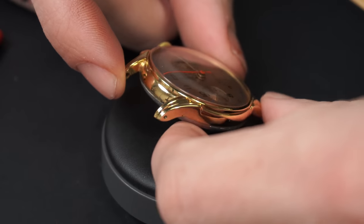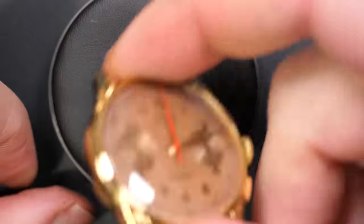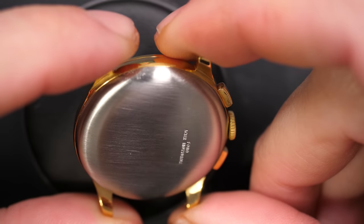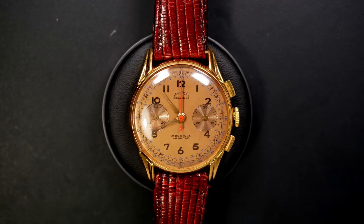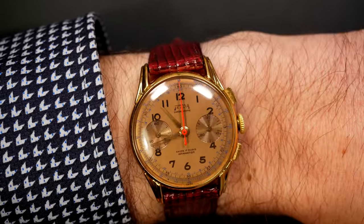Look at this beautiful gold plating - I'm really pleased with the end result on the case and on the case back. Look at that beautiful grain finish on the case back - so nice! I really love this watch. Now with this beautiful dial we have a beautiful case. On the timegrapher I'm not really pleased - the amplitude I would like to have at least 20 degrees higher. I noticed the mainspring barrel was quite scratched, so I'll probably change the mainspring barrel. The beat error is around one which is not too bad. But look at this beauty with this newly replated case! Hope you like the video and I'll see you next time for my next project. Bye!